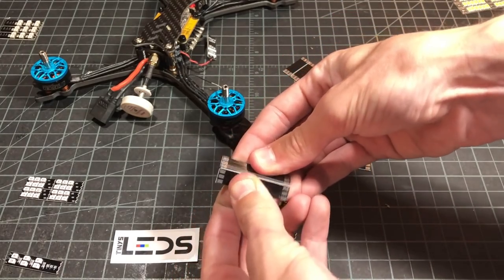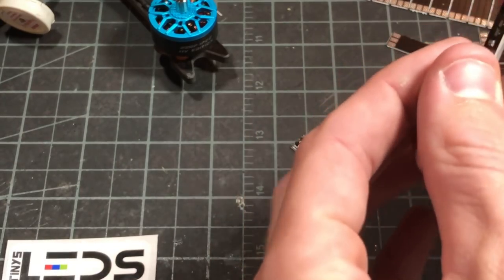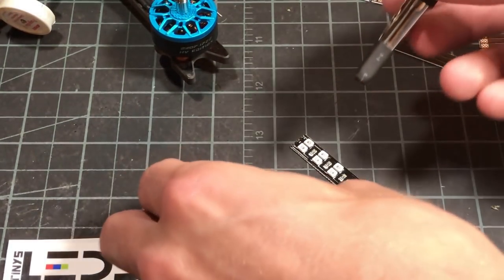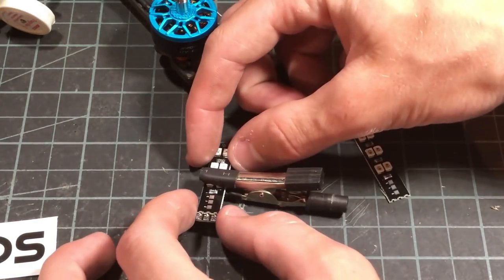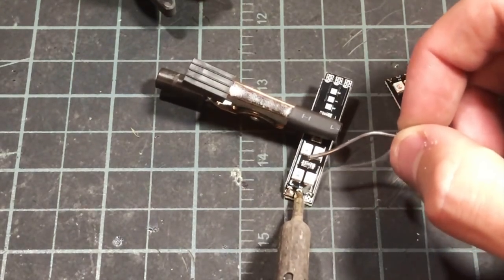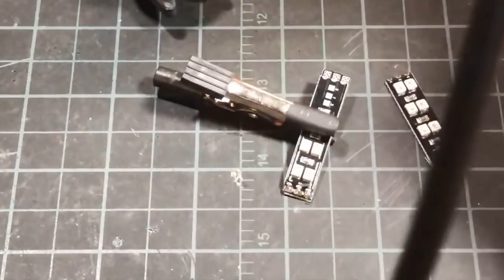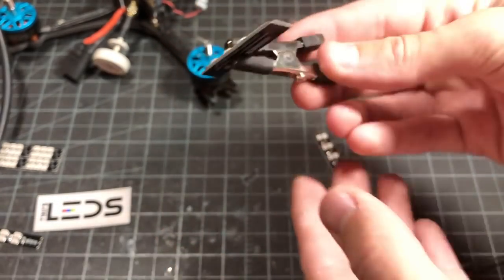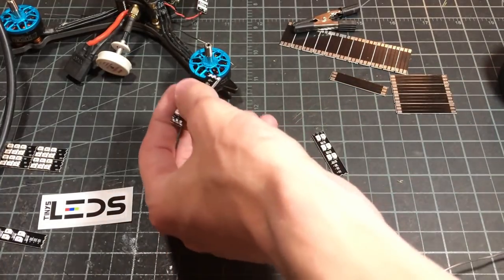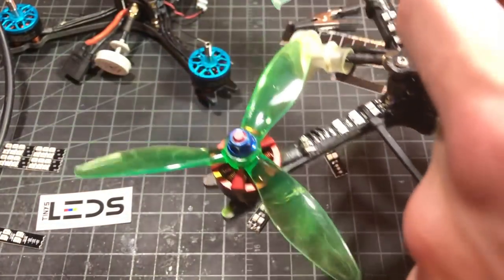For the back of the quad I'm going to put full-size race wires and blue race lights on top, so I'll break these boards apart. When you're soldering the race wire and race light together, you don't want to pre-tin these pads because that'll add height and the race light board won't sit fully flat. You pretty much just want to leave it as is. You can take a little clamp to hold the two boards together as straight as you can get it, then take your soldering iron and just tin and flow the two pads together. You want your iron decently warm since there is a bit of PCB and copper to heat up. The completed joints look pretty nice, and since we didn't pre-tin, the boards lay perfectly flat against each other. The LEDs are offset to one side - you can put that either way, but I prefer to mount mine with the LEDs towards the middle.